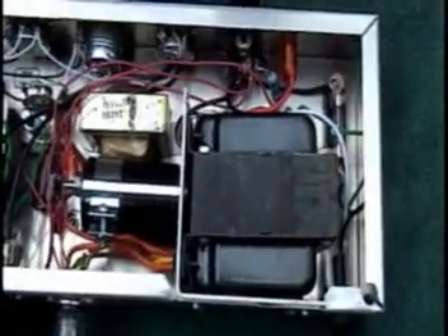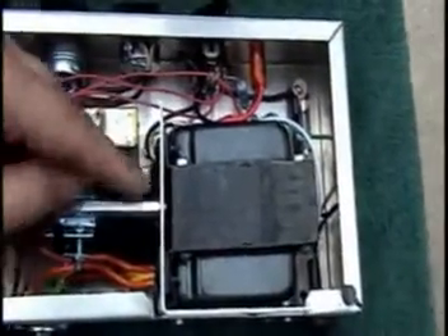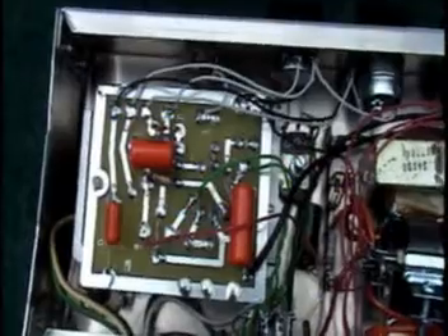Because of the tight clearances I had to actually put the power transformer on the side, so I made this L-bracket here which also has some standoffs that support the filter cap. It's a choke input supply, so it's super quiet. It has my tone board which is a trademark D-Lab item, and that supports all the components for the 12AX7 tube — there are no solid state components on that board. Tucked up in here you can see your input jack and your pots.